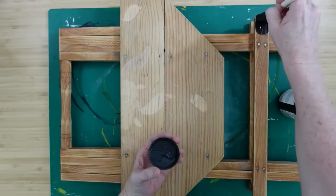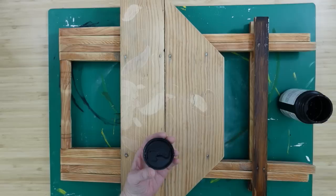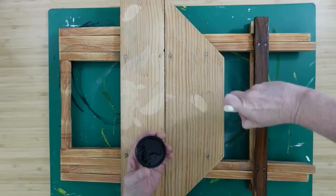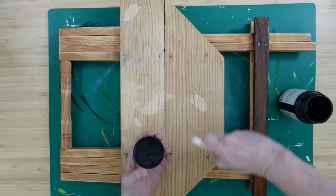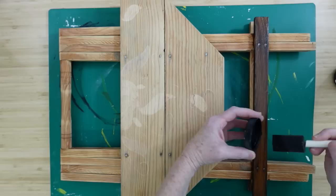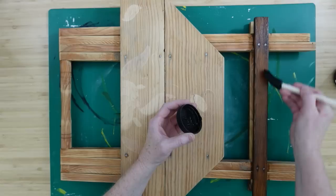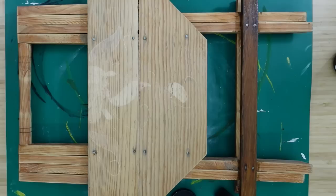This tint does what a stain does essentially, but it doesn't have the odor and it dries very quickly. I'm making sure I paint all the surfaces, trying to move quickly, wiping this on. You need to use long streaks when you do it because if you don't wipe it fast enough, you're going to have little white marks in there. Then just take a clean rag or clean paper towels and wipe off the excess.